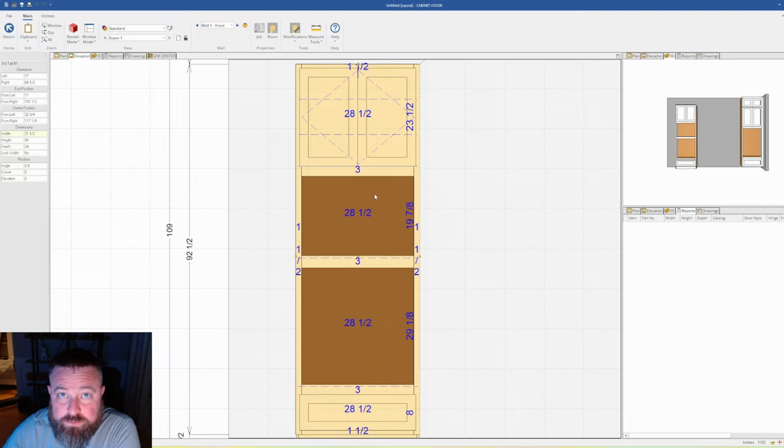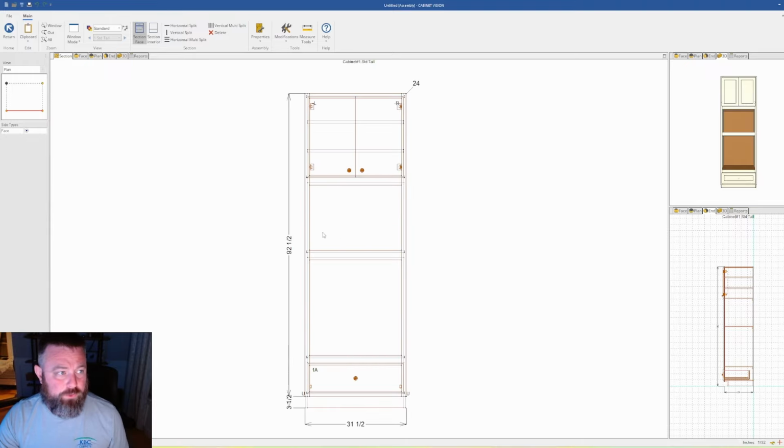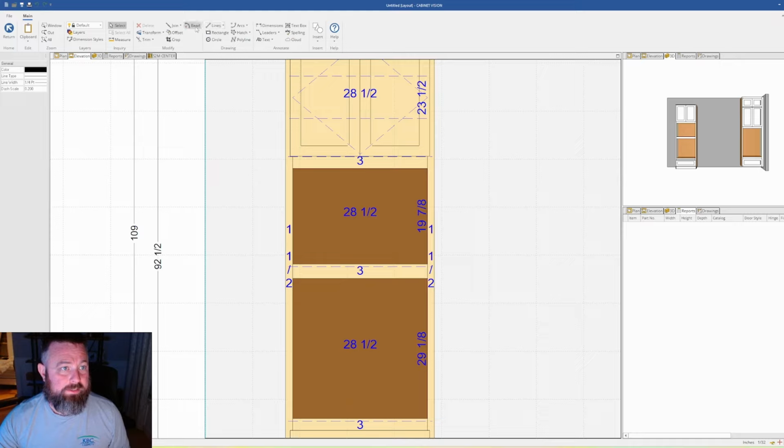And then you split the difference and you make two fillers, and you just cut them by hand, and you can either pocket hole them or pin it in or whatever, and you build in the fillers in that section after you do everything. And so what it looks like, if we go to the CAD, let's take a rectangle, so you would just build your filler pieces in here, and you would build your filler pieces in here, and then putty them, sand them, whatever, get it to that 24 and 3/8, and then you're good to go. Put your strips down there to get it flush.